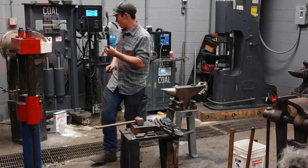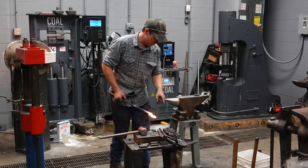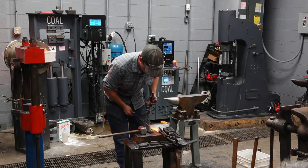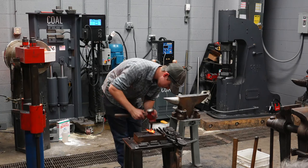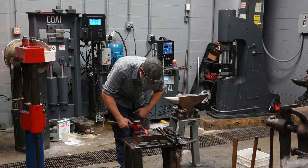And there's one more thing I'm gonna do. Who knows what countersinking is? Just a little chamfer on the hole. You can do that by using a punch with a slightly steeper taper. You can do that in forging, right? And I do that on tongs, so it's a little bit easier to fit the rivet into the pair of tongs. It also ensures that after you've been hitting on the hole a little bit and around it, the hole is swaged back out perfectly round.